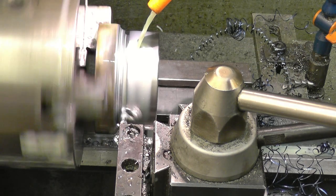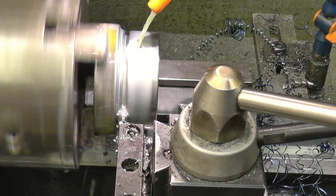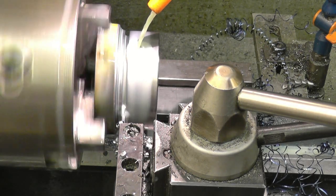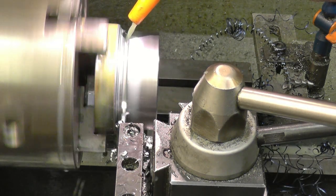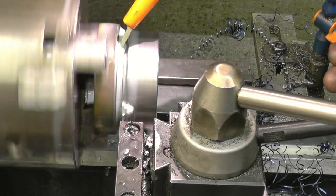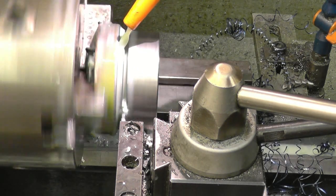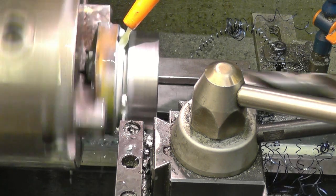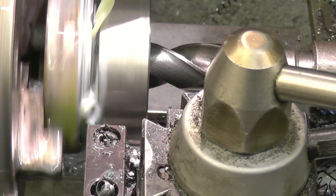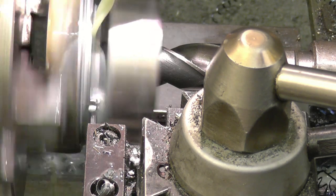See, the job's got a bit of a wobble on. That's just because I had a lot of coolant pressure on when I went through with the drill and pushed it straight into the chuck like that. As long as the outside and front face are parallel and square with each other — I'm cutting that quite nicely. The water definitely helps. You can see a constant flow — no pressure, no backing off. There's just a crescent that will break through.